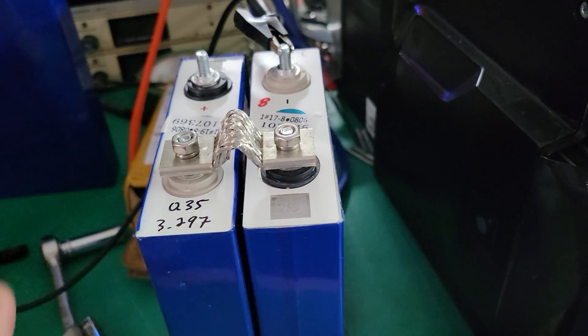Something very important that I keep telling a lot of people: never use the electrical bus bars as a structural element on the battery. The battery should always have its own structural components, and the electrical connections should be separated from that. That is very important.